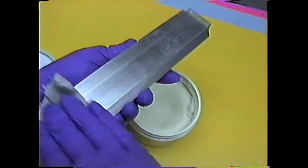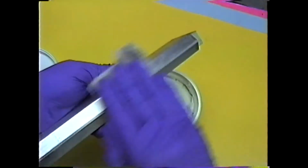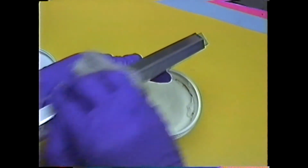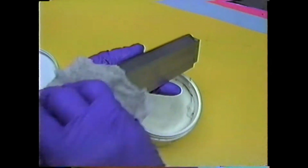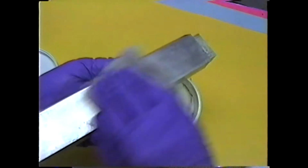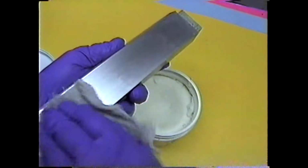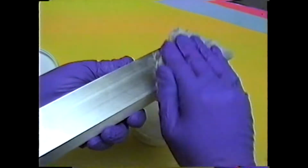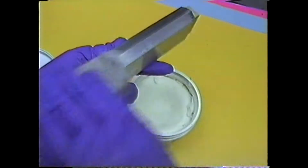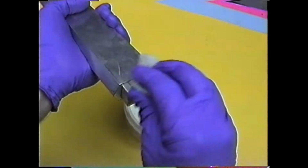Now I've used several different, in the course of learning the little tips of the molding operations here, several different tricks, several different PVA for one, silicone release agents from Smooth On. They all work in their own way, but this is by far the best one. Now typically what you do is you wax a part, make sure you get a good thin coat, buff it, polish it. Well, there's several ways they even tell you to do it on the can, but the best thing is to make sure you don't have any spot on a whole mold that doesn't have wax, or else you will not be able to get the resin off easily.